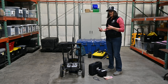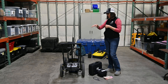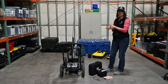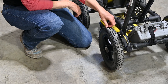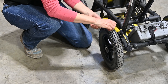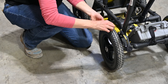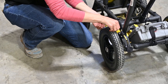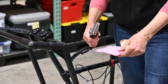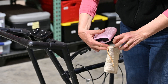Bringing it back from the field, we'd already taken some components apart, but now we'll show you how to take apart the rest of the cart and carefully put it back in the shipping container for safe return. A lot of times when it's been in the field it will have picked up rocks, so you want to spend a little time cleaning those out of the wheels so they don't get loose and scratch things during shipment. The 37-pin connectors are very delicate, so we want to take good care of them during transport by putting the socks back over them.